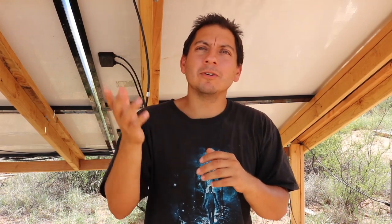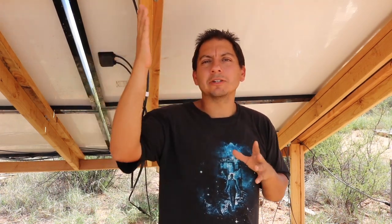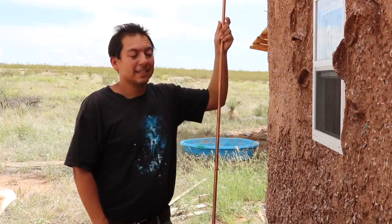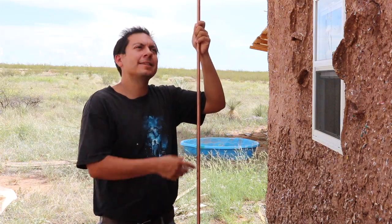I've got something to do before Derek comes back and we finish this thing. First, I need to get a grounding rod into the ground by the shed, and then that's going to get hooked up with a copper wire into the main electrical panel so that the system stays grounded. That's my work for today.